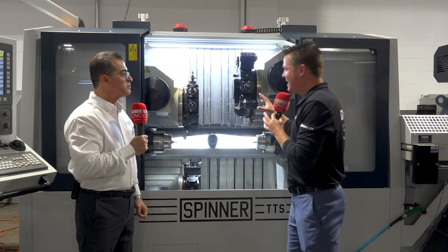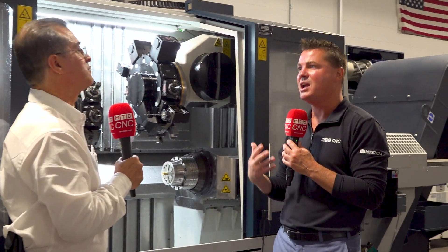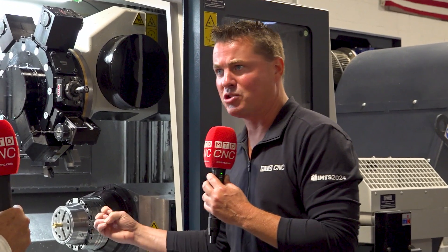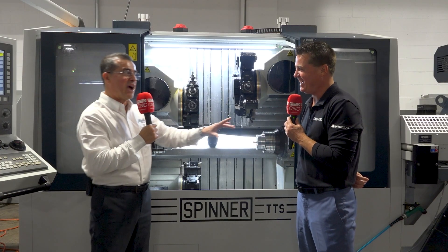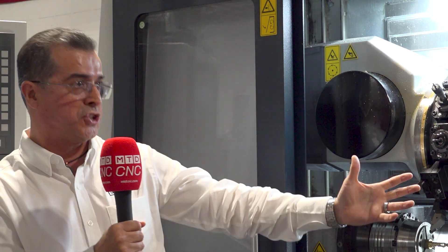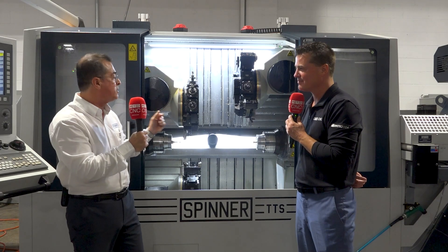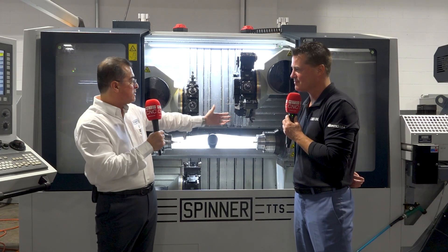So we've kind of gone over the concept of three turrets and three things cutting at the same time, which obviously reduces cycle times. We're getting a bar feed on the opposite side here. So we're constantly going from raw material to finished part in most cases. With a machine like this, when you have a bar feeder and the way Spinner constructs their machine, you get complete automation — you don't even need to touch the part. You can have your raw material coming in from the left side. You can use a 12-foot bar feeder or bar loader. You can use a short one, but you're always feeding parts, and on the right spindle you're finishing the part. Then you've got your part catcher and the part comes out complete, ready to be shipped to your customer.